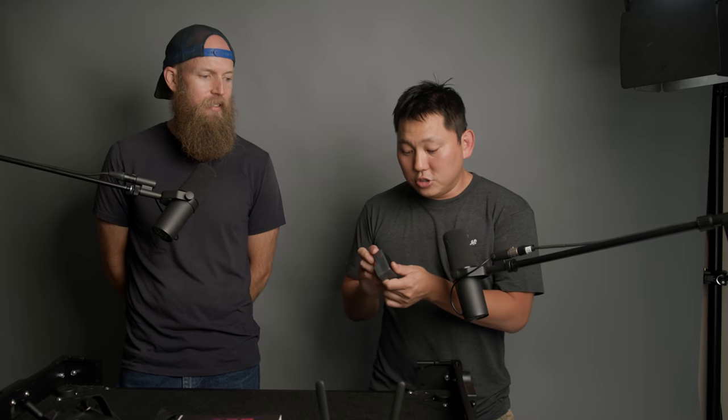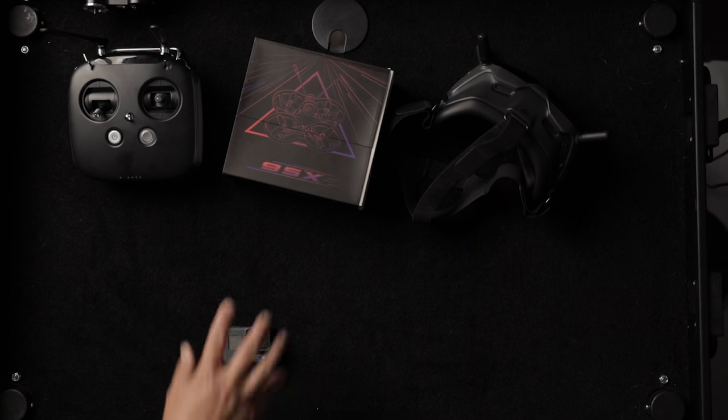To get good image quality, we're going to use this GoPro. The Hero 6 Black works really well with what Beta FPV has designed — it's more of a plug-and-play instead of trying to rewire a whole bunch of stuff. The biggest benefits of the Hero 7 and Hero 8 are improved stabilization. But to get the best image stabilization, we're actually going to shoot with stabilization turned off so the camera records all the gyro data. Robert's company, RealSteady, has software which will analyze that gyro data and really stabilize the footage. A majority of FPV drone pilots are using it, and it's really starting to catch on.